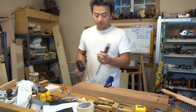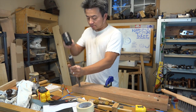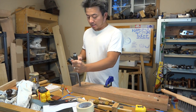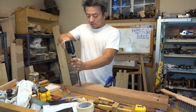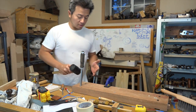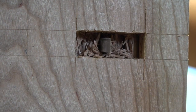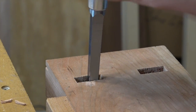I am siding it from the short end right now, and I find that to be very comfortable. This is typically how the Japanese and Chinese woodworkers would do it, but as you move west, the way the mortise is sided tends to be from the long side. So I've started digging the mortise from both sides — go about half an inch on one side, then go to the other side.